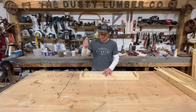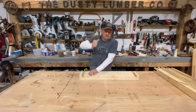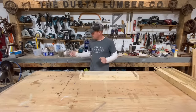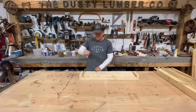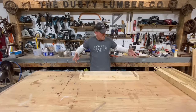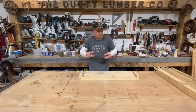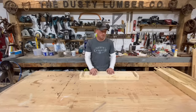What I look for is: when putting it together I have to kind of beat it in with my hand, and when pulling it apart I have to yank it. Glue goes in all the joints. If I notice something is loose, I'll clamp. I'll probably use my brad nailer at some point when I put the castle joints on, and tack in the back. I'll use my level and square to make sure the legs are all right. Depending on how tight everything is, sometimes I grab a clamp from top to bottom and pull the leg into the joint, or sometimes I flip it over, pre-drill through the half-lap joint, and sink a screw down into the leg. It just depends on how everything is fitting together.